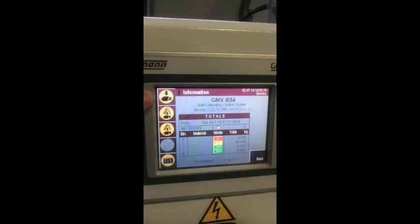You can perform file transfers and save them as a CSV file via the USB port of the power panel to a USB stick. To load a recipe from or to the USB stick, press this button to save all materials and recipes stored in recipe management to a USB stick, or press this button to load stored materials and recipes from the USB stick into recipe management. Pressing this button will reset all values back to zero.